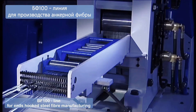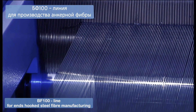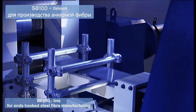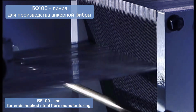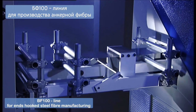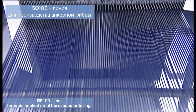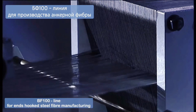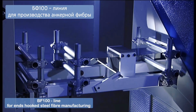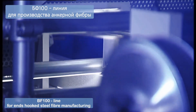Depending on the wire quality, a minimum rolling depth of 0.1 to 0.2 millimeter is required. Along this section, the wire feed-in length from the continuous feeder in the mill to the synchronized tool is regulated. While the wire is being bent and cut, the tool is closed. During this time, the wire infeed from the auxiliary feeder is stopped, and wire sag occurs.